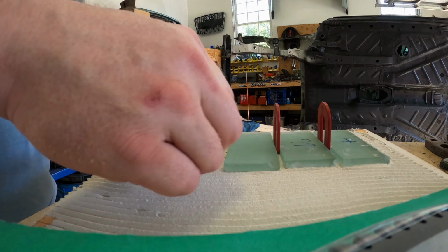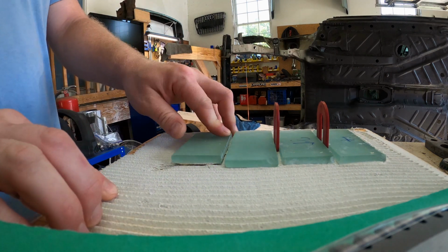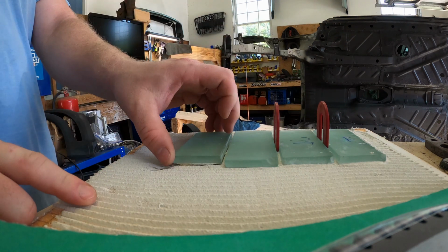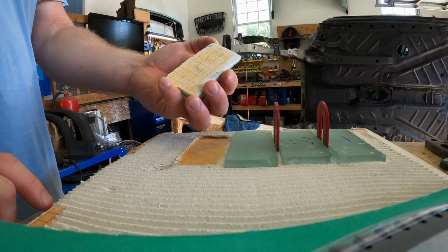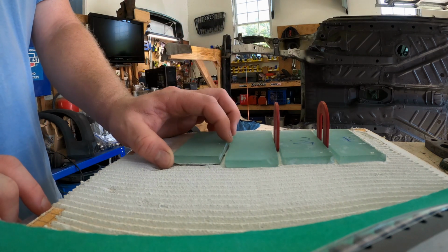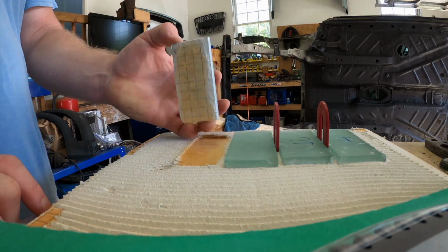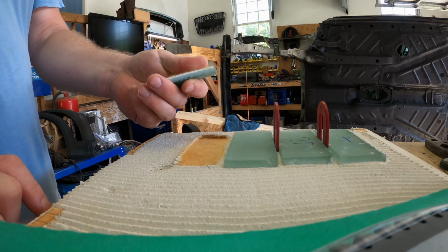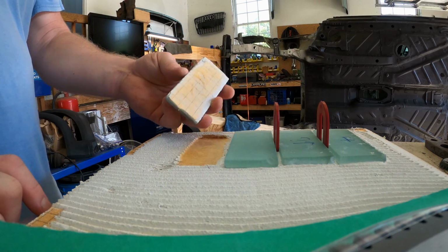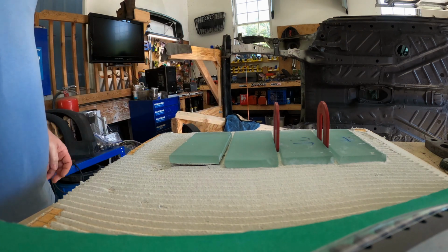But what we'll do as well is I'll cut another piece of scrap, and when I'm done doing the Ardex today, we'll take some of the leftovers and cover a piece of scrap. Then when we start putting tile on the wall, we'll thin-set some tile to the Ardex like we are in real life. We won't be testing it beforehand because I think it'll be fine, but it'll be confirmation, and we can peel it apart and show it to people, because I don't want to peel one off my own wall. But this is exciting. This tells me that this shower is going to be a great success.